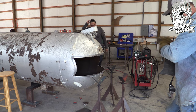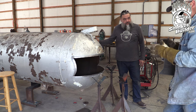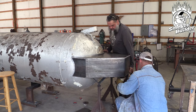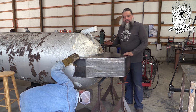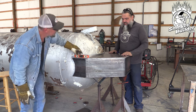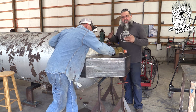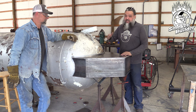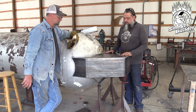What we've been doing is fitting it back on and making a few more marks to tweak things in. This is our last fit — I'm pretty happy so far, I think we're there. Part of this fitting is that once we cut the hole in the end of the bell, it actually relaxed and sunk in. And as soon as it did that, it changed all of our lines. This is the part where you just keep chipping away and slowly fitting it in there. There are going to be a lot of factors — this is going to be out of round, and then it's going to be out of round again once you cut it open. Just anticipate you're going to be fitting all the way up until the very last minute, and then it should be right there on the money. And that's where we're at right now.